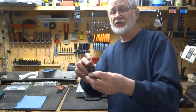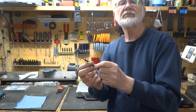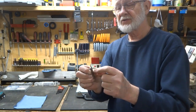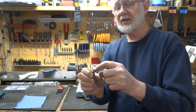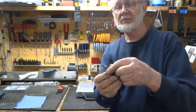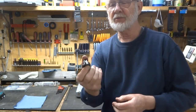This one accepts a quarter inch tool. I made this quarter inch piece of soft metal — it's just like key stock — and I drilled some holes in it. I used a broken center drill to put in the hole here, put a hole in this end with a thread in it, and a screw that just holds it in place. It all fits in here just like this, clamps up, and I can adjust it in and out for the size of the hole that I want. So we're going to go through the steps that I made in order to produce this thing.